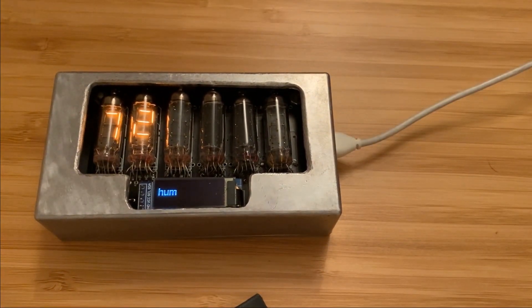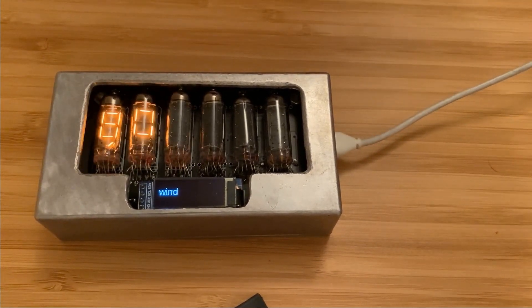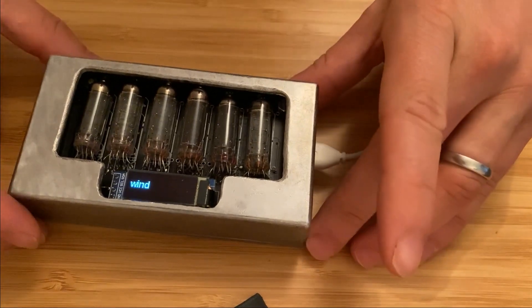What I've never really figured out is why these took so long to be invented. They were originally marketed by RCA in 1970. 1970! How did someone come up with high-voltage neon tubes to display numbers 20 years or so before coming up with a glorified light bulb? In fact, RCA actually came up with these while they were in the process of imploding themselves with the CED player — I'll link a great video series by Tech Connections in the description. Anyway, these aren't RCA Numitrons. As is tradition on this channel, these are the Soviet knockoff version: IV-9s, manufactured in 1979.